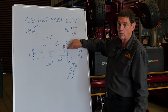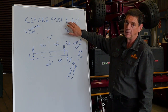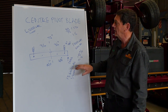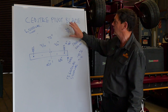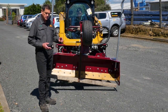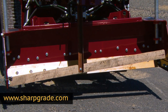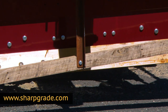So not only does the quad rod linkage reduce the load, it also reduces the ratio, so your cylinder is virtually over the top of your sensor. You can see why a center pivot blade is the worst possible combination — there's nothing smart about it. If you want accuracy and speed, you don't use a center pivot. Visit us at www.sharpgrade.com for more information, and thank you for your time.